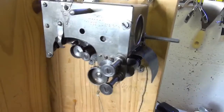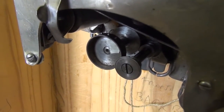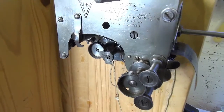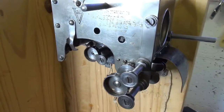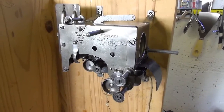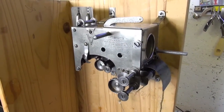So there's no damage there when we're testing this out. I've marked up the sprocket to make it a little easier to see what's happening. The idea is to see whether it will work at a reasonable speed without any nasty knocking noises or other things happening. That would suggest if it does that we're okay to carry on, and that the thing will eventually work as a projector at 16 frames per second at least.